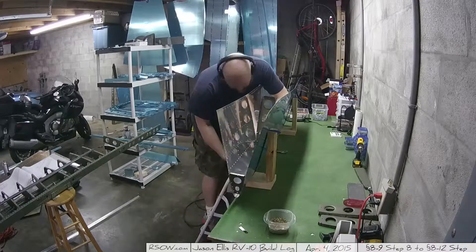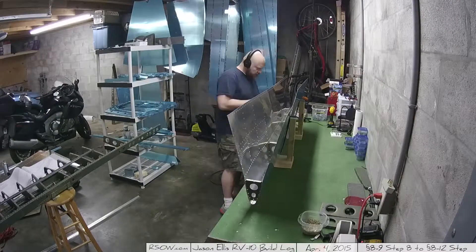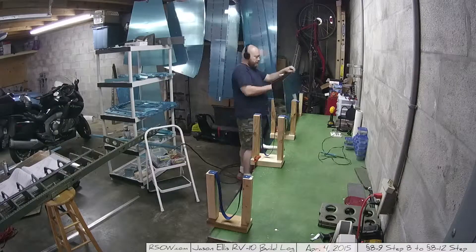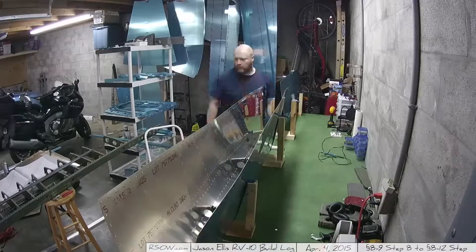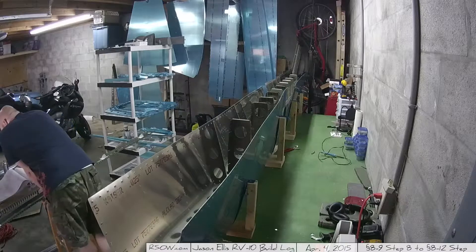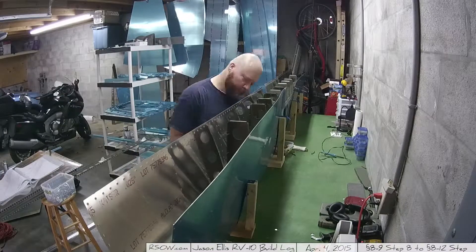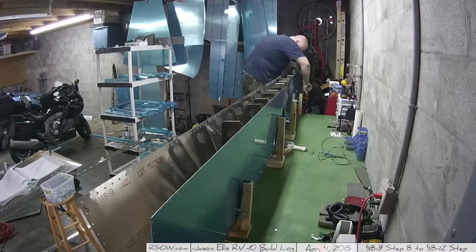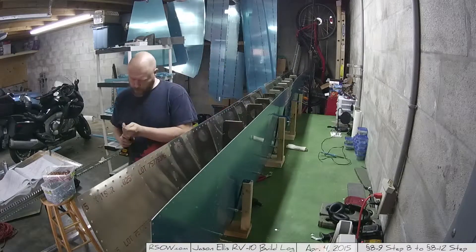Right here, when you're doing the nose ribs — the very top of the nose rib — if you don't use one of the in-spar ribs as a helper to kind of close the gap, it's too much of a gap and it makes things difficult. And here I'm drilling out my mistake. I'm finally reading the instructions and I realize, okay, now what do I need to do? Which side is top? That became important — remember from earlier, you marked some of the holes. So it's very important to know which side is top and which side is bottom. Once I'd figured that out through the plans, I threw in the assembly and was ready to start mounting it to those nose ribs. And that's what I'm going through here — using blind rivets or pop rivets to mount those inner nose ribs to the in-spar ribs.